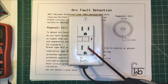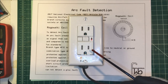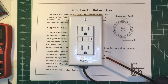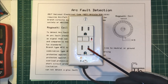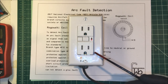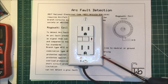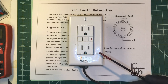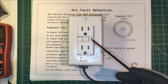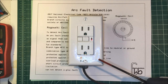If you have a 60 watt light bulb and you take the switch leg and try to make an arc, it's never going to trip because 60 watts at 120 volts is only about half an amp, and this thing needs five amps to trip. So I plugged a 1500 watt space heater into it, took the switch leg and arced it, and it does trip. You need to sustain the arc for about a second or two and then it trips out.